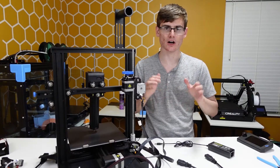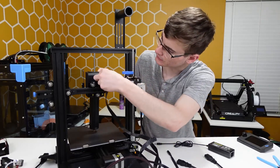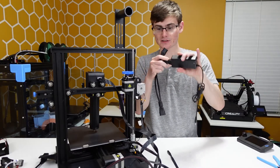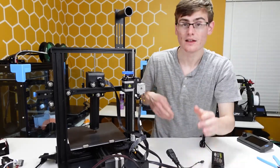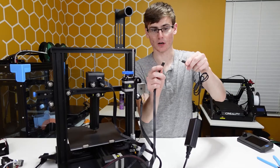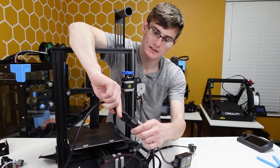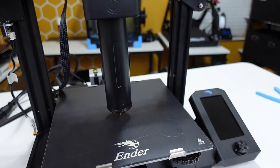We are nearly ready to power on the Lucky Bot. Take the Lucky Bot's power connector and plug it directly into the Lucky Bot. Then take the power adapter provided by Lucky Bot — one side goes into their power adapter, the other side goes into the 3D printer. Take the barrel connector and plug it into the other part of the cable that went into the motherboard. Finally, plug in the printer's original power cable into the Lucky Bot power cable. Everything should now have power.